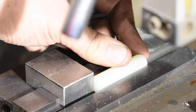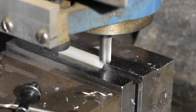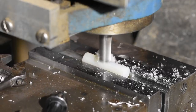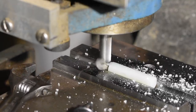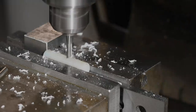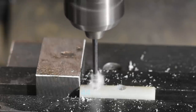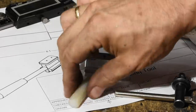Now I'll mill off the top of a piece of half-inch nylon rod, which will act as the sanding form. I'm using nylon because it's very durable but relatively soft. I don't want any sort of material here that might gouge up a multi-thousand-dollar sword if the tool slips. Also, having a little give helps the sandpaper maintain even contact with the groove. Then a couple of holes that mate to the tool body — I'll start by milling a quarter-inch pocket for the cap-thread mounting screw to fit into, then a clearance hole. And this is how it mounts to the tool.